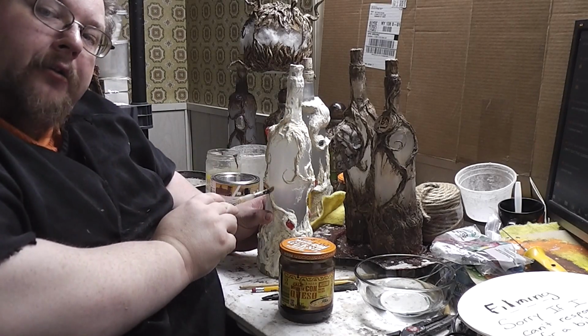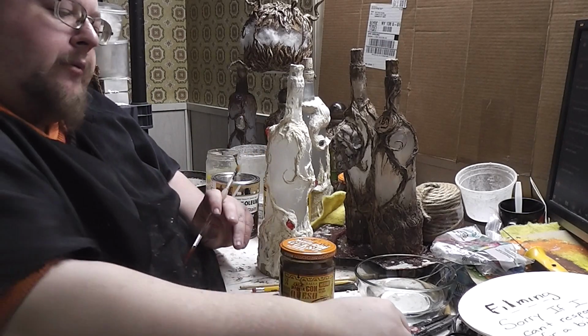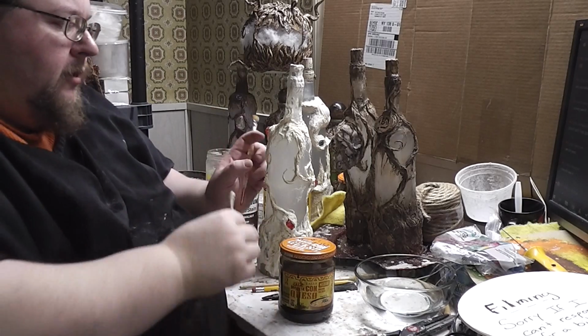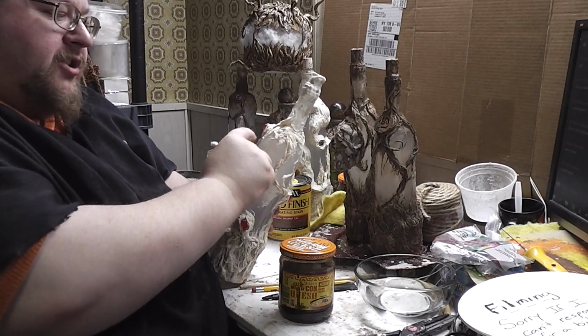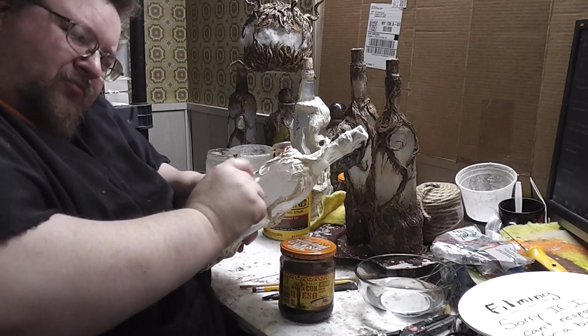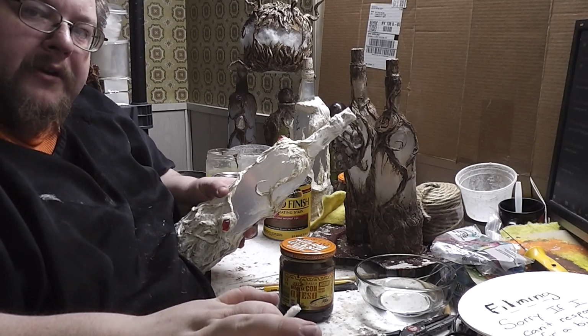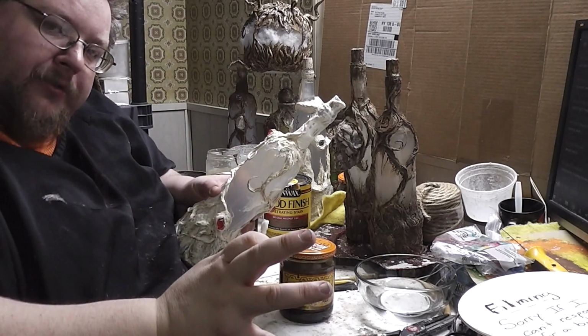It's going to drip down. This is to be expected and not worried about. Later on, if I don't like the look of it, I will grab myself a Q-tip. I'll find those areas where stain's dripping down, or areas where stain's just gotten everywhere, and I will just vigorously rub that Q-tip in there, and the stain will get pulled off. It will not adhere very well to that glass at all, and you'll clear up your glass with that.